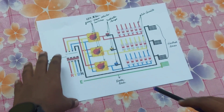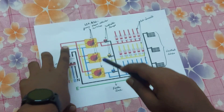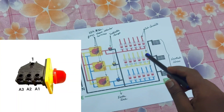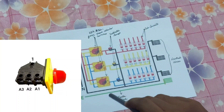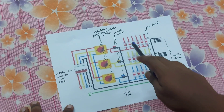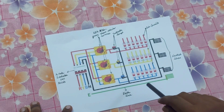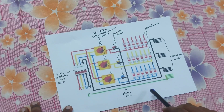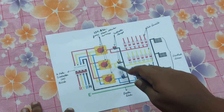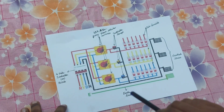In this wiring diagram, you can see that all 3 switches have been connected to the 3-phase supply via the incoming terminals A1, A2 and A3. Each switch has 1 outgoing terminal for each phase. The outgoing terminal connects the load by means of sub-circuits, along with the earth and neutral links. We can also connect indicator lamps for each phase across the outgoing terminal and neutral. Indicator lamps help us to know about the status of power supply.